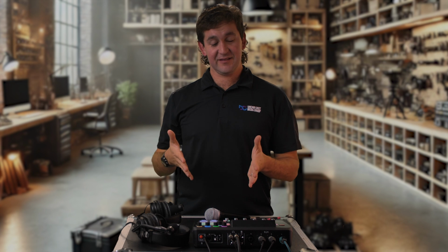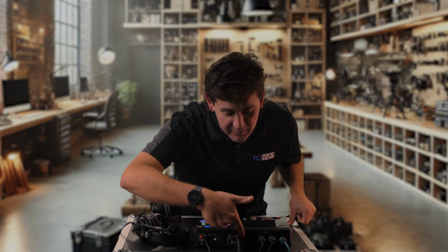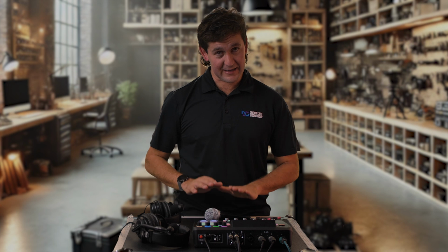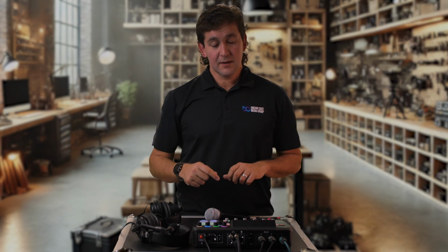Let me go in and show you how to set up the monitor. One thing that I don't have set up right now is how this is making it to the stream. How is this getting onto the broadcast? Right out of here, these two stereo outs go into a commentator camera with an XLR input, and we pull out a 1/4 inch XLR input, and this contains our mix for both commentators 1 and 2 and our mix minus. So this mic is not on the stereo out.